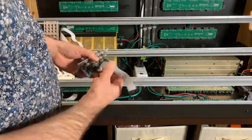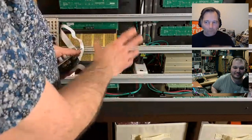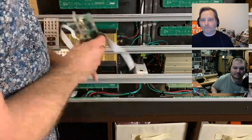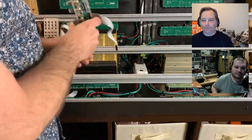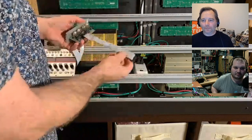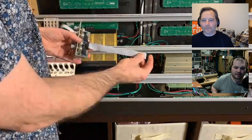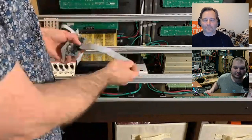I mean, now since I've already installed the modules once in the previous case, only to find I didn't have enough power, a lot of them already have at least this connected, and the libs have shrouded headers. But the last module I fried, I had a cable that was wired wrong. The connector was backwards on one end. Yeah. And when I plugged it into something that was shrouded on both sides, it fried the module.